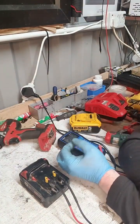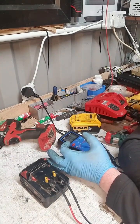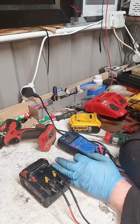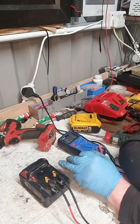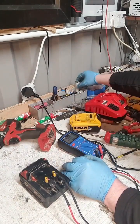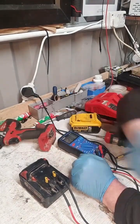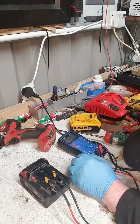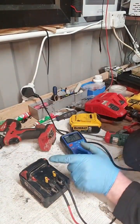If it's anything below 15 or 16, that means there's some reason why the battery's low. There can be a couple of cells — there's 10 cells in this, it could be two of them fried. The whole bank of cells could be low and then you can bring the voltage up; sometimes you can save them that way. But this one's different, because this one's sitting at full voltage and it still won't go.